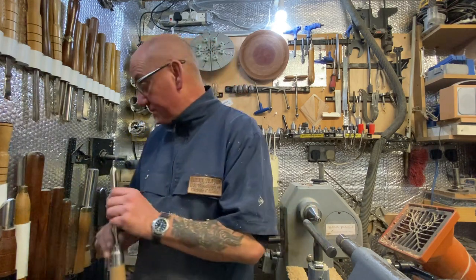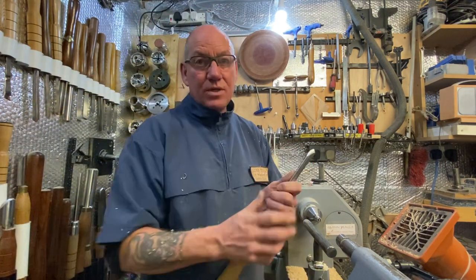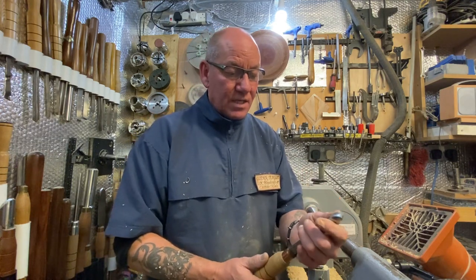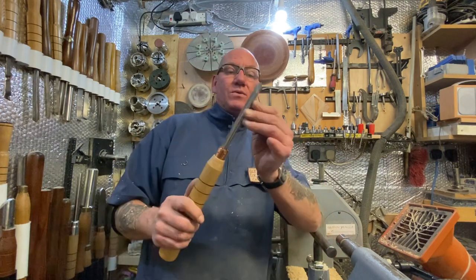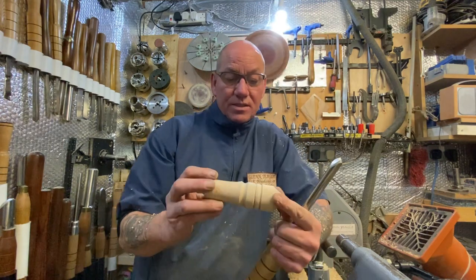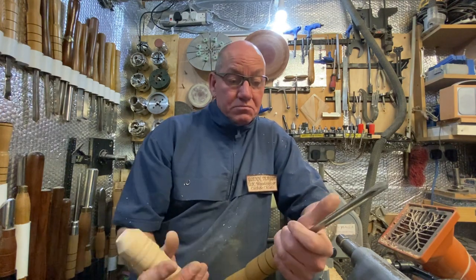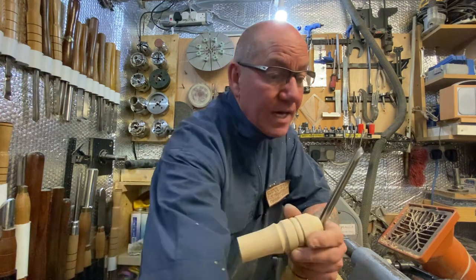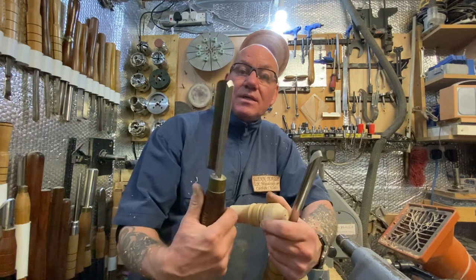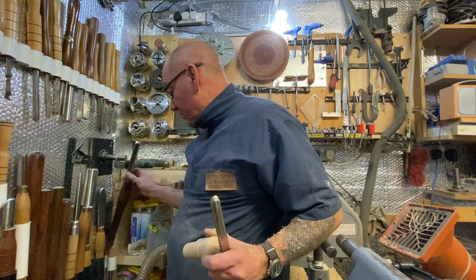And you just go and sharpen it. Don't worry about what wing, don't worry about this angle down this side. Don't worry about this, what you got here, when you come over. Just go with the flow, go with whatever it is. Okay, that's fine. That will do, and there you go, spindle gouge. As you can see, you can do all those little bits. You take the bottom of a bowl off, you could even hollow part of a bowl with that. There you go. Okay, and your roughing gouge, well, you see what that could do. You see that gave a cut like a skew chisel. And there you go, single facet all the way around. So there you go, guys.